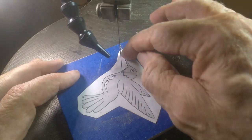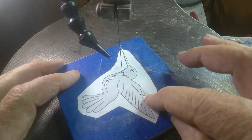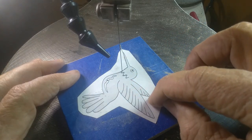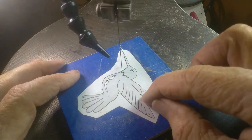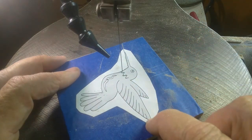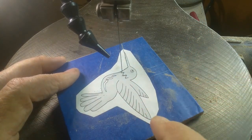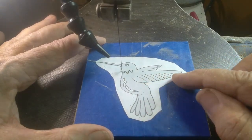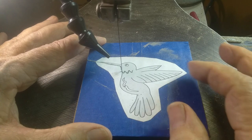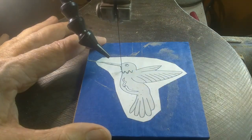It would be better to come on top of that beak and come around this way. I would do the back-end cut here, and out here I would just flip around the edge of that wing and come back in, then come out here and turn around and go out to the tip of the wing. If you're coming in from this direction, it's easier to get up in that veining — it's not as sharp a turn — and you just back out, just like backing a car out of a driveway.